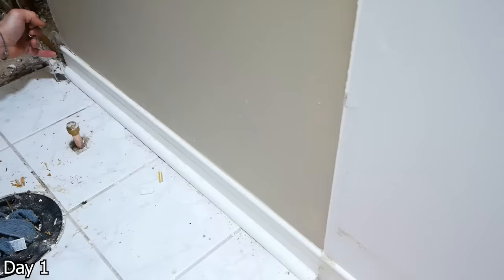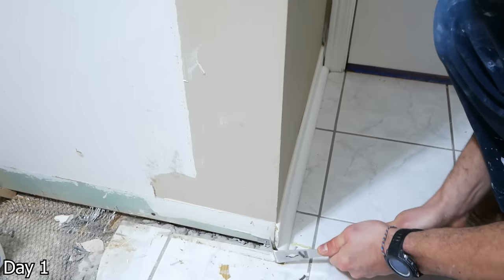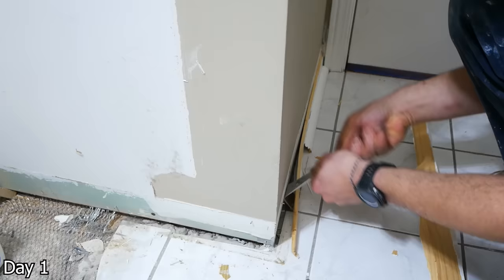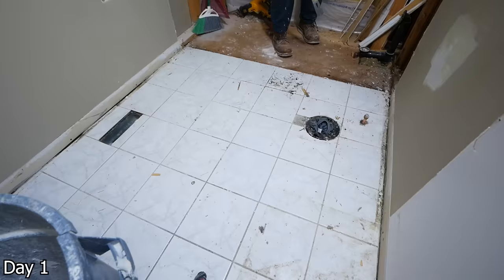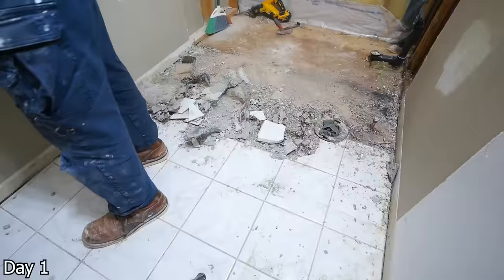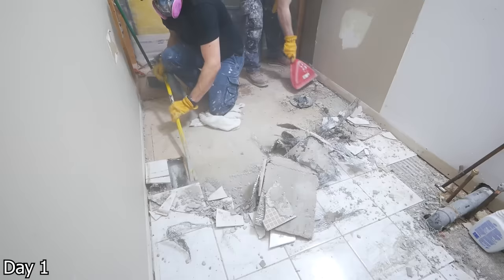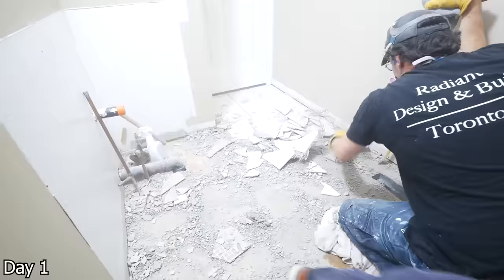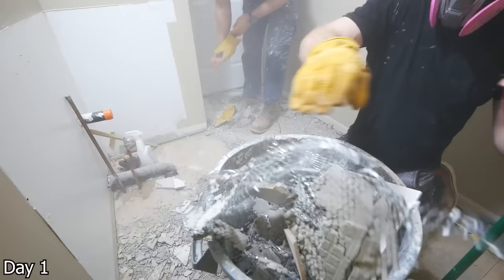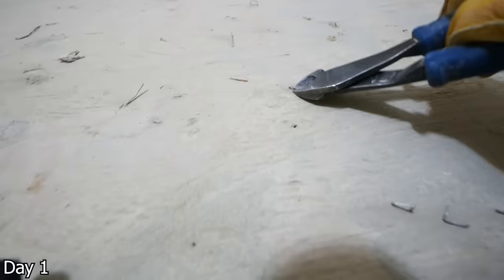To remove the baseboard and trim, score along where it meets the wall to cut the caulking, then take a glazing bar or drywall knife — anything skinny and flat — and pry it away to get the brad nails released. Typically it's pretty cheap stuff in a builder grade bathroom, so it will fall apart as you do this. You can make a case for reusing it, but if you're going to all this trouble, you're better off buying new. For the floor, we're using a three-foot pry bar. The installation here was a lath underlayment — that metal chicken wire — so get the pry bar both underneath the tile and underneath the lath, then pull up section by section. With a lath style installation you'll also have staples, so use side cutters to pry them all up one by one.